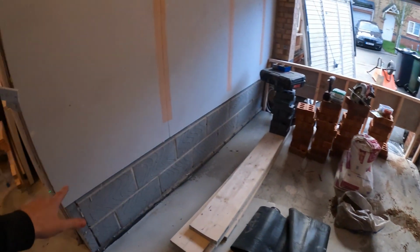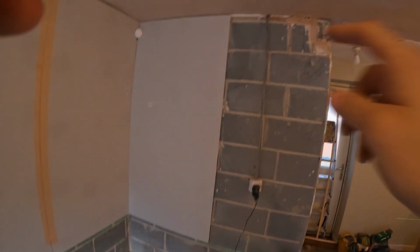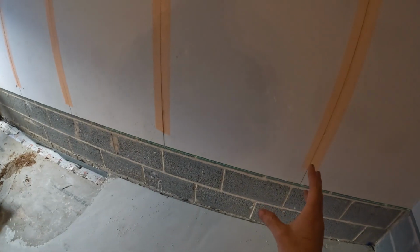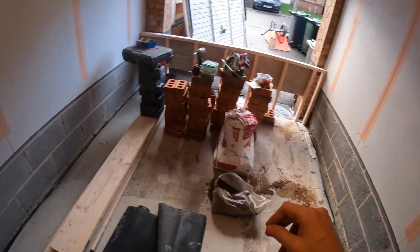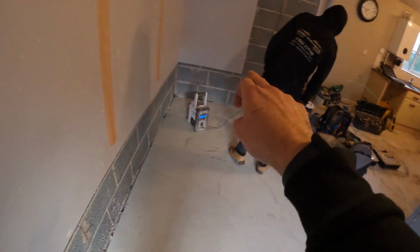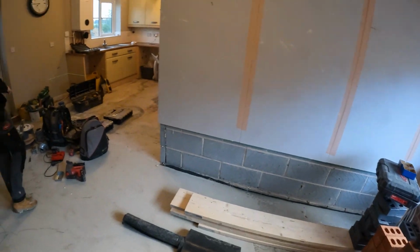Nice, this has got to be the easiest extension job going. We've got a little laser set up, so that's for the top of the box all the way around. So what we're going to do then, socket's going to go in here, which puts that cable in zone. Then we take two cables around into three sockets along here, and there's going to be two sockets on here. So we've got 1, 2, 3, 4, 5, 6 sockets in total. That'll be the sockets done.